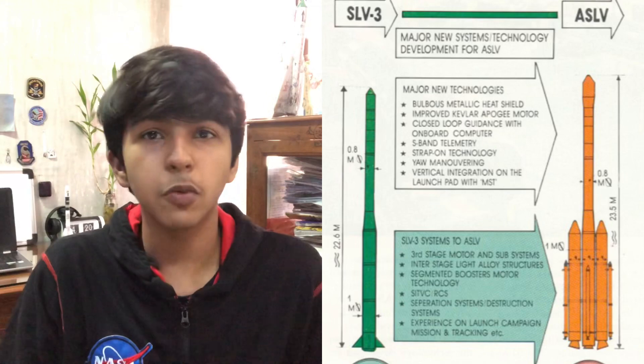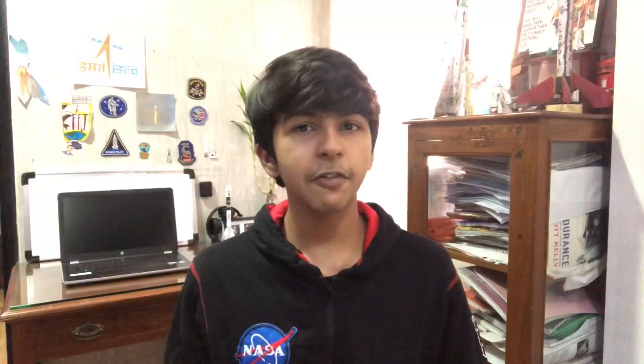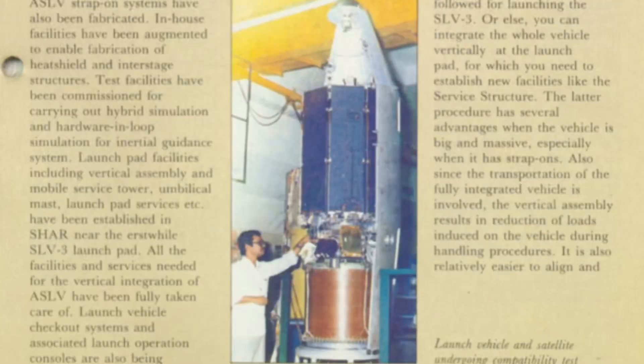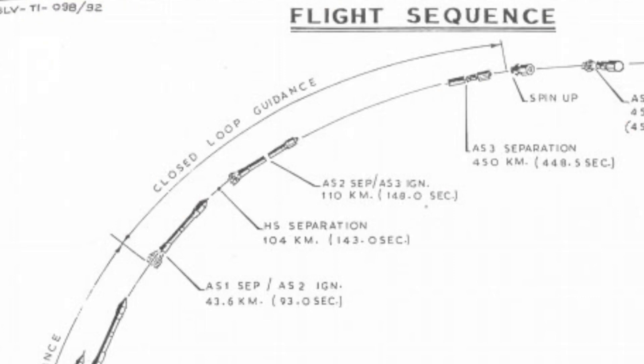So what are the differences between the ASLV and the SLV? The first and most obvious difference is the addition of the side boosters on the ASLV. The ASLV also had a brand new bulbous fairing at the top, which allowed it to carry slightly bigger satellites into space. The new bulbous fairing also tested out a new pyrotechnic separation method and reduced aerodynamic stress on the vehicle. The second difference is that the ASLV used a closed loop guidance system, which meant it could take measurements from the onboard sensors, put it into the flight computer and change its path mid-flight — which is not something the SLV could do.